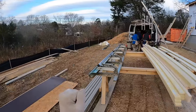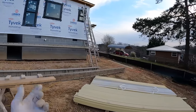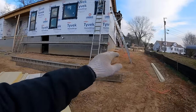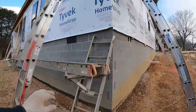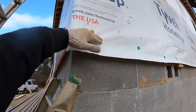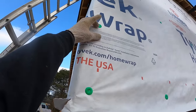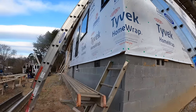You actually have to bend it for the Z flashing at the bottom that they're going to be putting on the sides. And for that, I'll be using white flashing because then I'll have a stone, and I'll show you as I'm explaining a little bit better here. So right here, there's going to be stone on 3 sides, and on the back, there's stucco. So right here, they're going to bend out the flashing. Boom, it's going to come out. Then I'm going to have my stone butt up underneath, and then there's going to be another Z flashing on top of the trim board that's right here as well. So that's going to turn out pretty darn good.